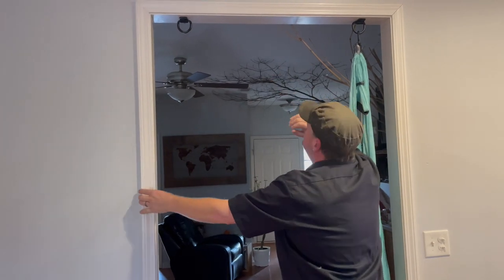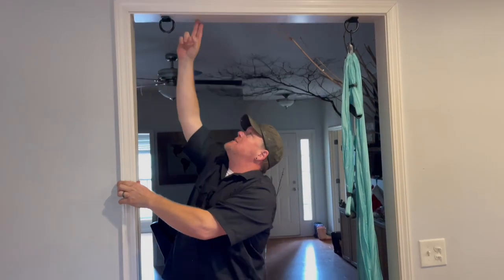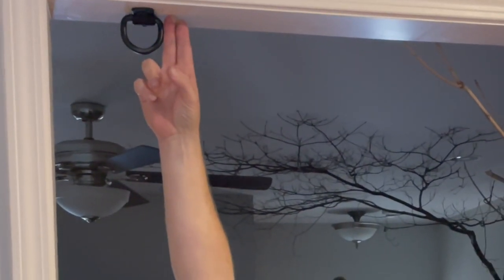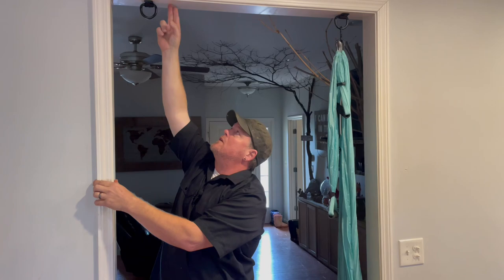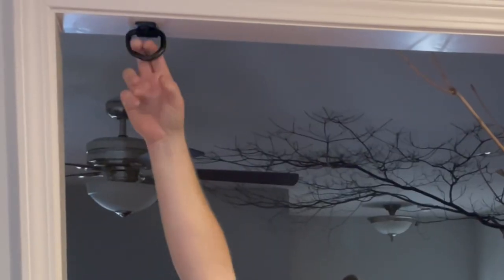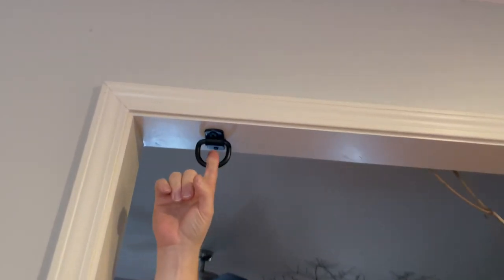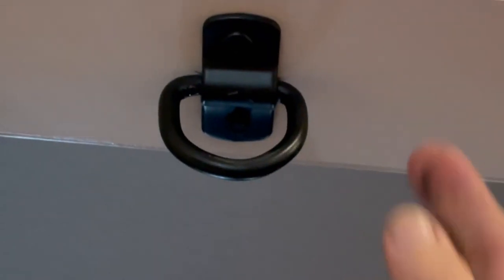So you want to be careful there. I took straight center — I'm assuming the center of this is my half-inch spacer, whatever header's up there. Header board, half-inch spacer, header board. So I put this right in the center, took my six-inch Timberlock, zipped it up in there, but stopped when it was tight to this board.